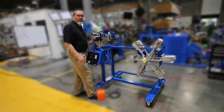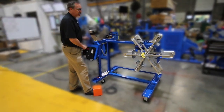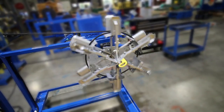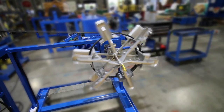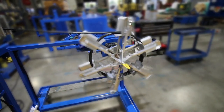You've got your material loaded and passed through to the coiler. Set the rheostat to 0, then press your pedal. Slowly bring up the speed of your machine. While holding the 1700's handle, manipulate the measuring head so it evenly distributes across the face of the pads on the coiler.